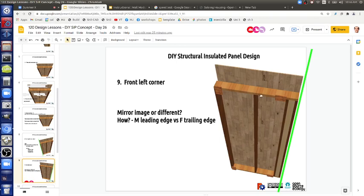So if you were left without blueprints for it, you can start with a standard 4x8 framing, but you know it's 1.5 shorter, so you gotta cut it down to 46.5. The OSB is going to get trimmed. Oh yeah, but here it looks like it's going to get trimmed even more, isn't it? Because, right? It's going to get trimmed by, I believe, 1.5, because you're starting on a panel that's already shorter than 48, which is 1.5 inches, right? And then you're also cutting off another 0.75 for the male end. So it's actually like 2.25. I think that's what the number works out to.